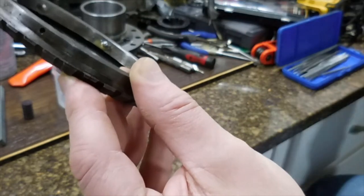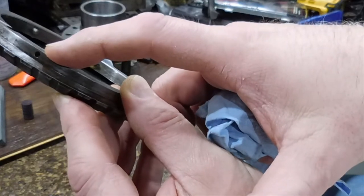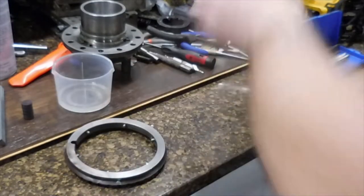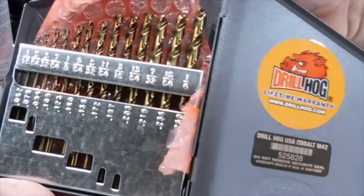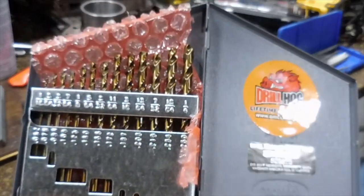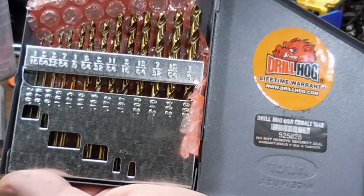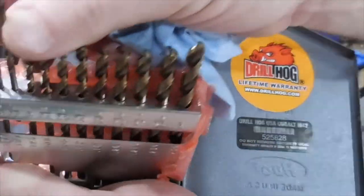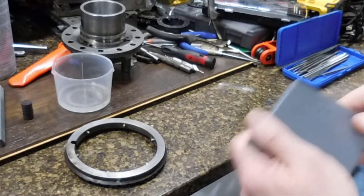So when I came in from the back side and put a small hole in there I was able to drive that out and everything freed right up. But this material is extremely hard — it laughed at my center punch. So I went ahead and used a center drill on the mill, got it all set up, started it out beautifully straight, and then followed up with a little set of Drill Hog bits that I got from Drill Hog for participating in their recommendation program. These were fantastic — it zipped through that hardened steel like butter. The actual bit is a 7/64" bit and it isn't any worse for the wear.